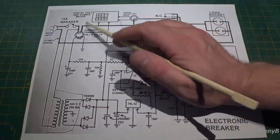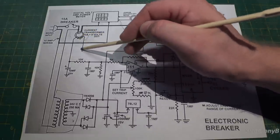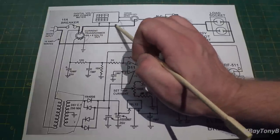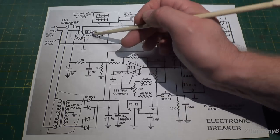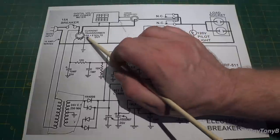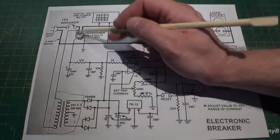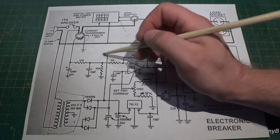The main part your power line goes through is only one turn, but this secondary is somewhere around 2,000 turns. So if you want to wind that — thread that wire through that hole 2,000 times — you've got a lot more willpower than I do. But you can buy these. All this does is convert a current to a representative voltage. For instance, the one Ron used: if you pass 15 amps through this little wire, you'll get approximately 8 volts AC out of the secondary. That's really important because it sets up your reference. It's pretty linear, so at 15 amps you'll have 8 volts, at 7.5 amps somewhere around 4 volts. But because of the permeability of the core, it's not going to be completely linear all the time, so you have to design that into your comparator circuit.